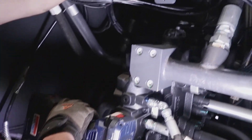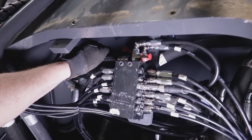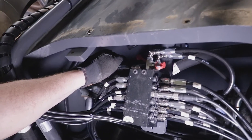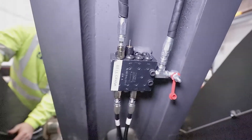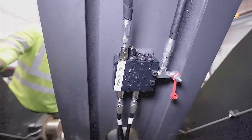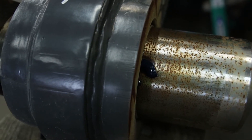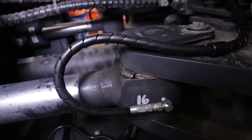It is now time to bleed the system using an electric handheld grease gun or bulk dispenser. Connect to the added hydraulic fitting on the inlet to the primary valve and dispense into the valve. This will cycle the primary valve and move lubricant throughout to prime the system. Dispense lubricant until the secondary valves begin to cycle, indicated by the movement of the visual indicator pins on the valves, and you see lubricant flow out the main bucket pins. Inspect the remaining secondary valves and lubrication points for any leaks or line issues.